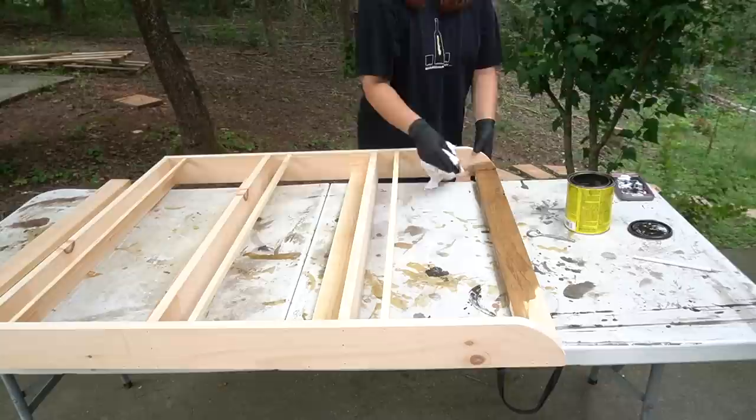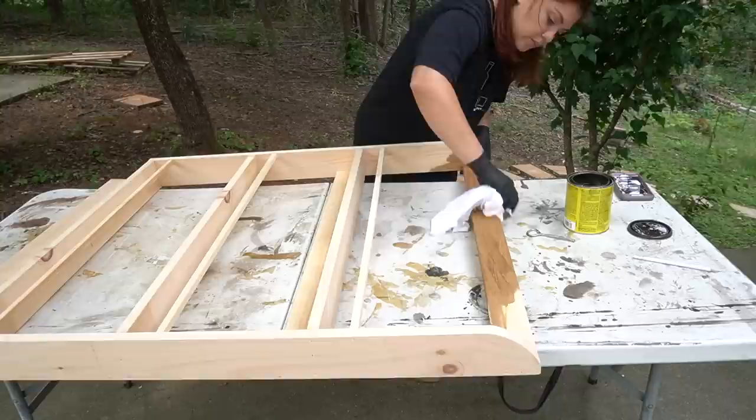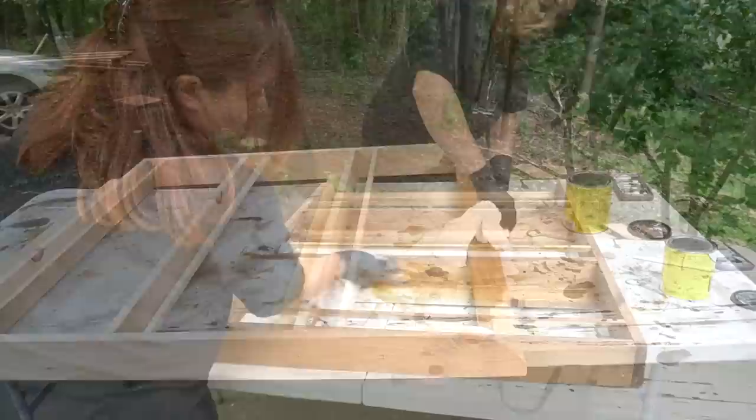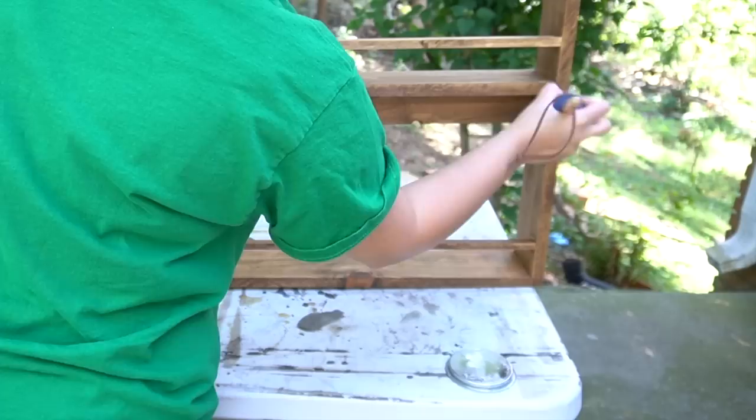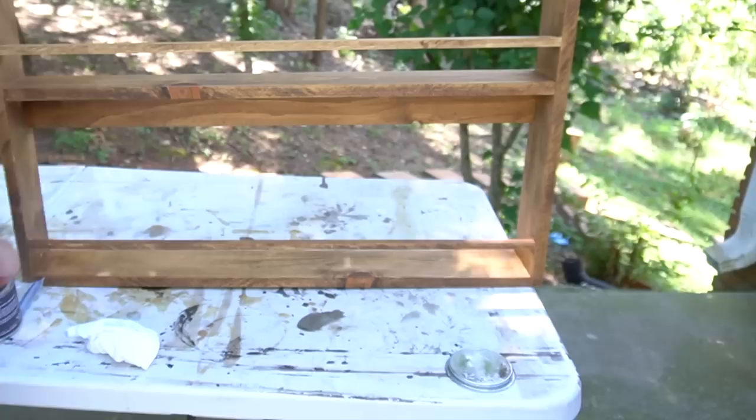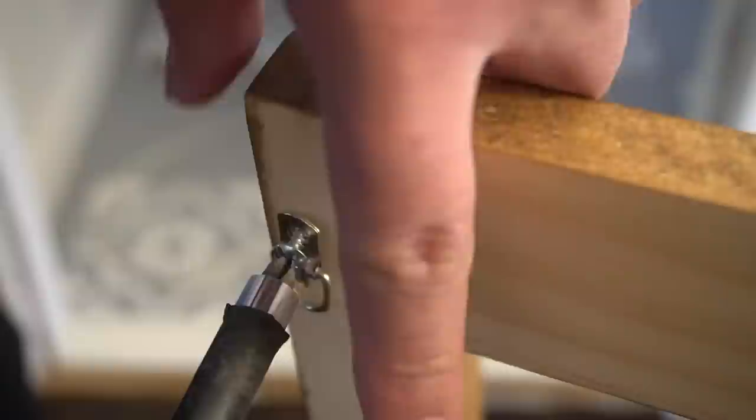Then I gave the entire thing a coat of stain. I didn't want anything too dark — I'll link in the description box which stain I used. I wanted something to look rustic, but I also didn't want it to be too dark on my very light walls, so I went with something with a medium stain. I let it dry overnight, and the following day I came back with Debbie Design Diaries Clear Wax and gave it a coat, applying it with a wax brush. Then I leave it to sit overnight again, and the following day I come back and buff it with a lint-free cloth. I have had this clear wax for a very long time and I love it — it goes a long way.